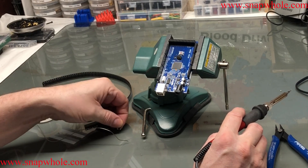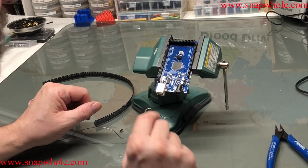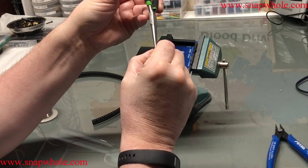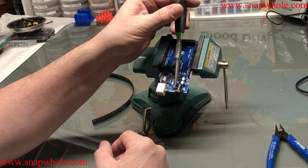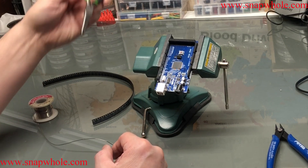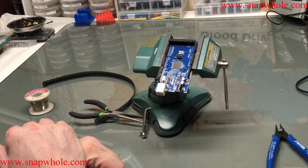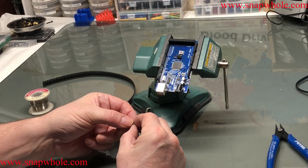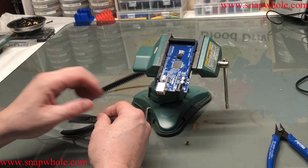The key to this is going to be to place the replacement on there. I want to put some solder on that front. And that did lift that pad — and that's why you never try to save the part. It lifted the pad. That was bad. Well, let's try this.